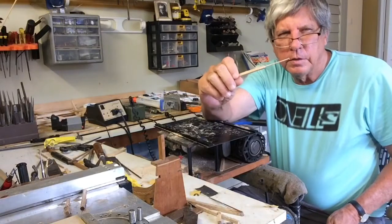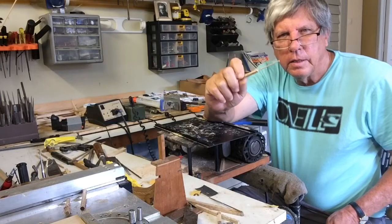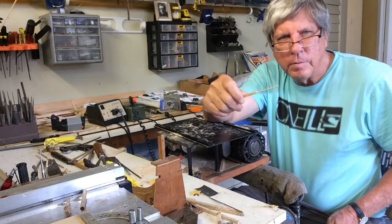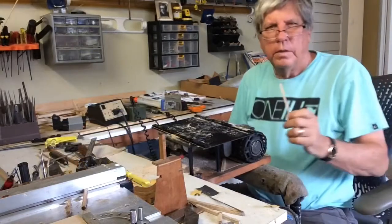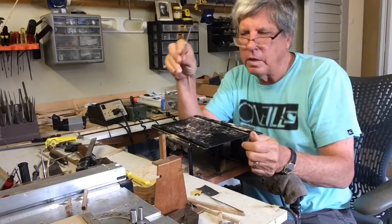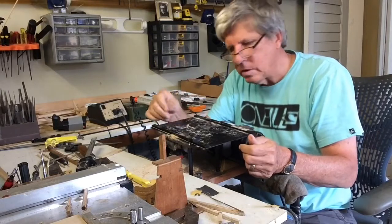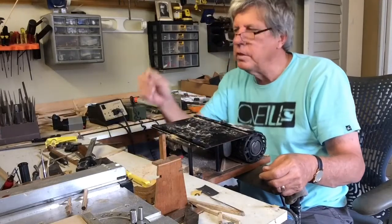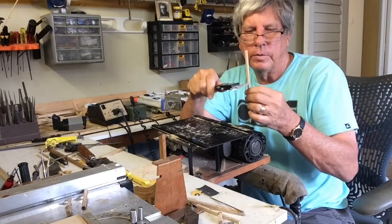We're going to cut this stock down to 2.5 millimeters square. So I know I've done this before, but I'll just do it one last time so you get a reminder of how easy it is, in fact, to make these parts. Just to go through it again, the first thing you do is you're going to set up the depth of cut. It doesn't matter the thickness of the stock. You start low and slowly raise. You can see there's a little adjustment screw here. Raise that up until your vernier caliper gives you the correct measurement.